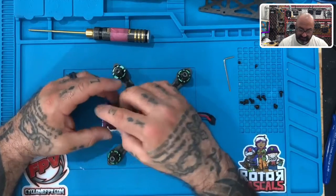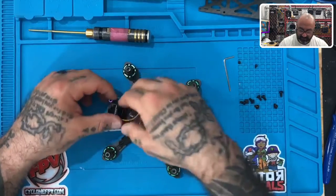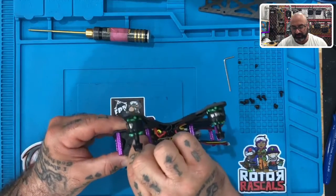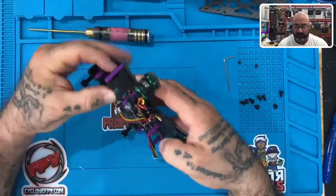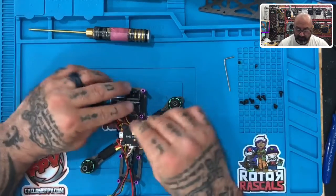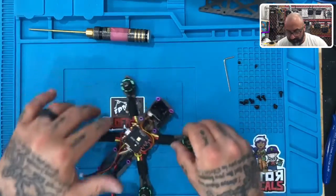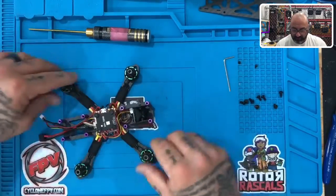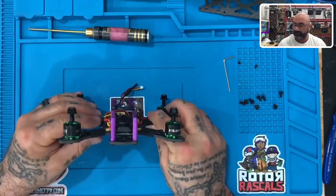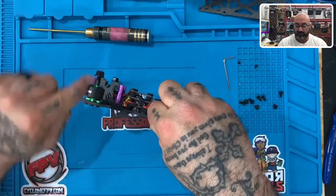When you're ready, bring the wire inside just like this, then snap these pieces into the bottom plate into those small slits at the front — and you'll see it just like that. If you have a hard time getting it to fit, unscrew the camera just a little bit from one side, because it may be that you've got it screwed down so tightly that it just can't spread far enough to fit in these slots. Once you do this, it should look just like that. Get it to sit in properly and we will tighten the camera down once and for all when we're done. Make sure you have those slits on the bottom facing the back on both sides, and screw holes on the top.